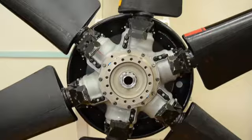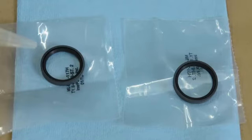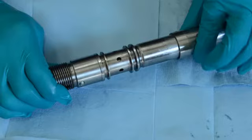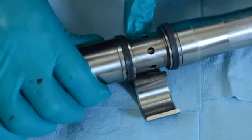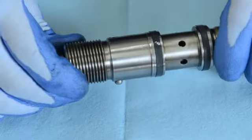Make sure the actuator piston and blades are in the feather position. Apply a thin layer of lubricating oil to the ring seals and the external surfaces of the outer transfer tube. Use the split ring and expander help tools to install the two O-rings and outer cap seals onto the transfer tube grooves. Be careful not to overstretch the cap seals. Remove the split ring and expander help tools from the transfer tube. Inspect the step pin, making sure it is firmly held in the correct position. The pin should not move freely in the transfer tube.